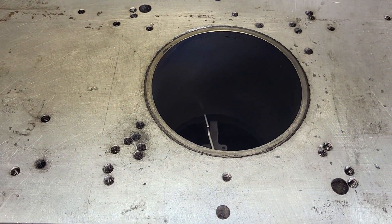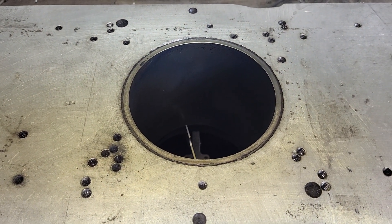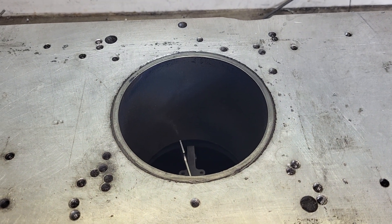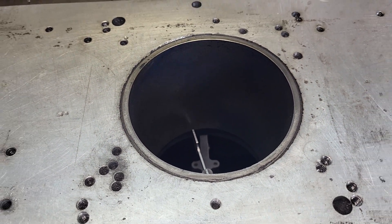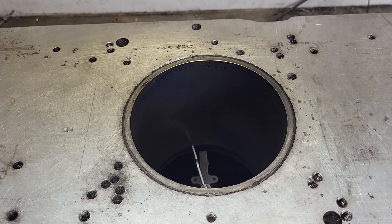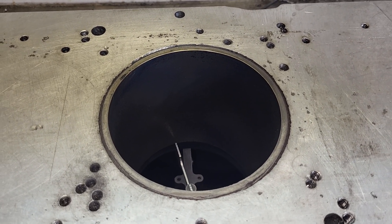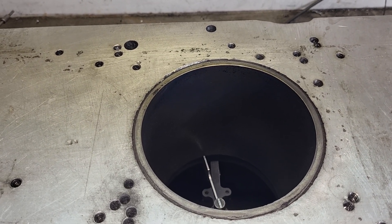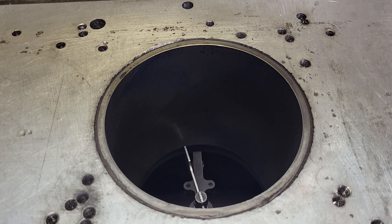My bore adapter has a ton of holes drilled into it, which suits me just fine, because every time I get a different head that needs a place to mount, I just drill this. This is three-quarter-inch thick aluminum. I drill it down enough that I can use a quarter-20 rod to actually fasten it down to the bore adapter. If you see guys using clamps, I don't know how they get a good seal on it. I have had to use clamps in certain instances, but I don't like it at all — you really have to stay on top of your leakage.